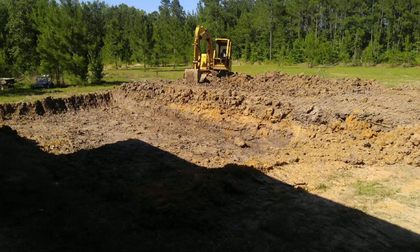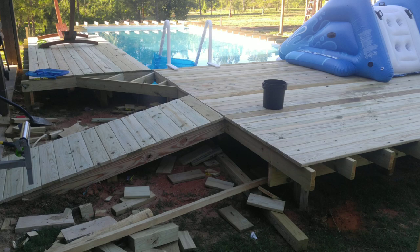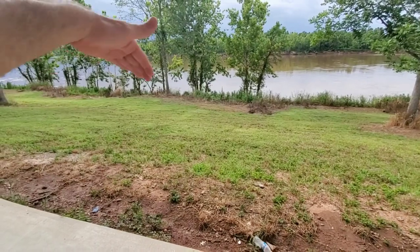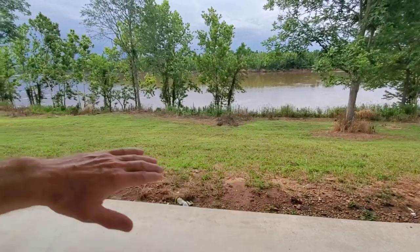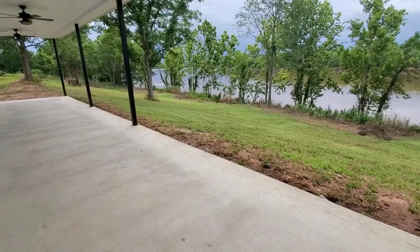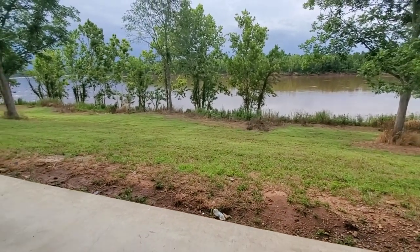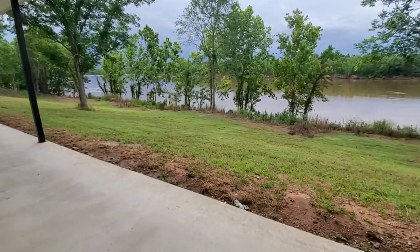Here's what I did at the last house — we really loved it, though I did wish it would have been level with the concrete, and we can actually do that here. The plan is to dig out the dirt, compact it down, build a little headwall down there, probably get some concrete and put a couple inches down. Then I'll use foam board like people use in house sheathing — lay that down on the concrete and put the pool on top. The foam board is something I saw online where they did the same thing: concrete with foam, giving you a little pad when you're walking.